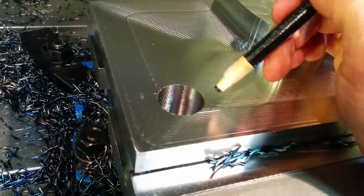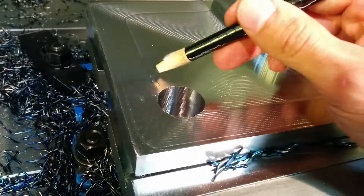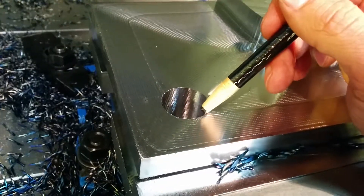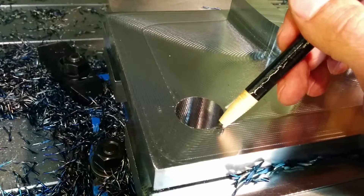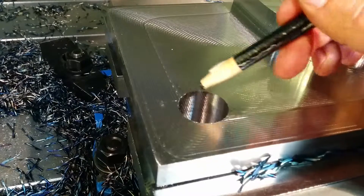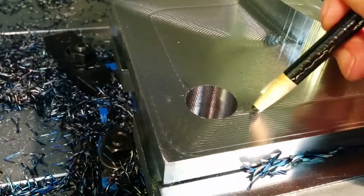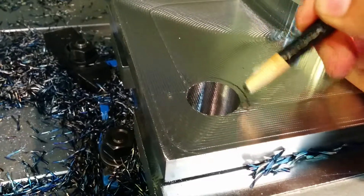This hole right here caused me a lot of issues because I wasn't paying attention to it. When I was going across it initially I was just doing the full arc, coming back across almost like the hole didn't exist. So I had to reprogram it so it knew the hole was there, and it started taking this little edge piece out. The little flap occurs — you take the flap out while it's running — and then it goes in and starts doing one of these curved approaches, rounding this edge off. I think it takes the impact out of the tool going from a hard edge to a hard edge. It starts to go in, you can hear it hitting, and it smooths out the edge, actually forming a radius. Then it just keeps going farther in so this gets cut away without wasting too much of your tool pad.